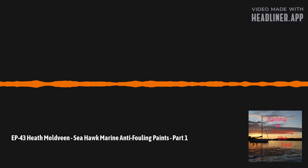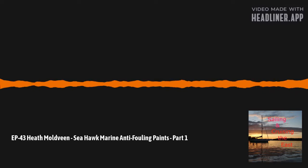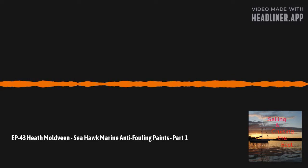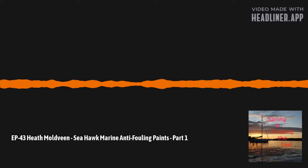And the idea is basically that you encapsulate the biocide with the resin. And by doing so, you're getting new performance, new protection coming out of the coating stack all the way through the life of the paint. So as long as there's paint on your boat, you tend to have really good performance. You don't have to do that diving and scrubbing that's required with those harder, traditional modified epoxy paints.